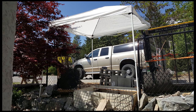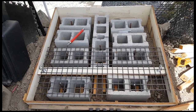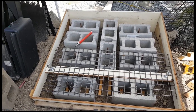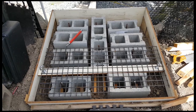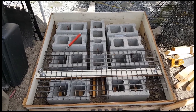Now we're set up to do the reinforcement and put in my concrete blocks — you'll see what I'm going to use those for shortly. I had to put up a canopy to get a little bit of shade. It wasn't the nicest weather — it was very hot, 33 degrees Celsius or 91 degrees Fahrenheit. I've laid my 10 blocks in the form. The idea of the blocks is to add reinforcement to the slab and reduce how much concrete I have to pour. We're doing about 10 inches here, so that's a lot of concrete to mix by hand. The blocks are half the price of the concrete mix, so whatever volume I displace with blocks I'm saving in dollars.